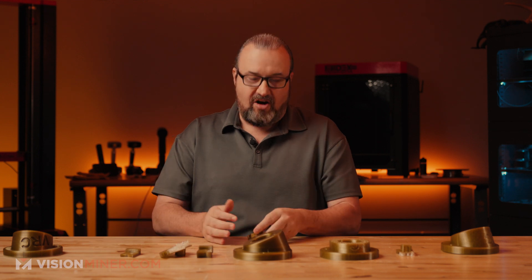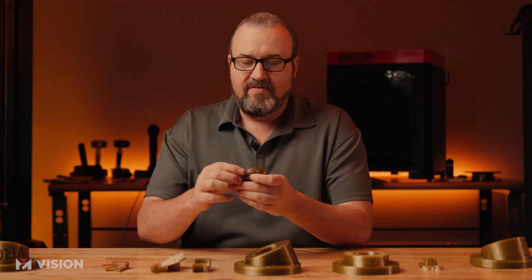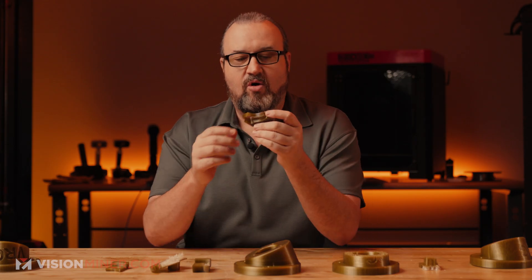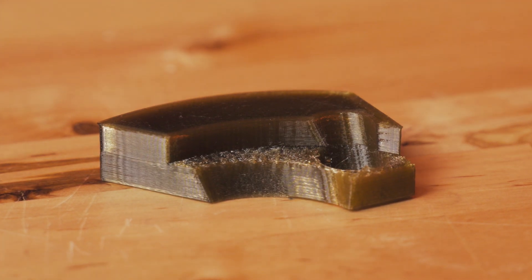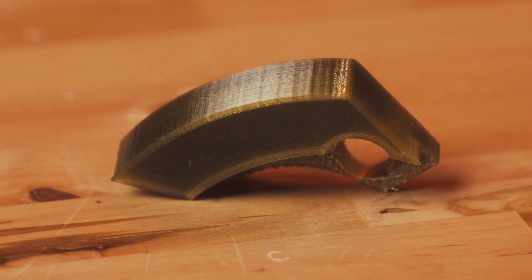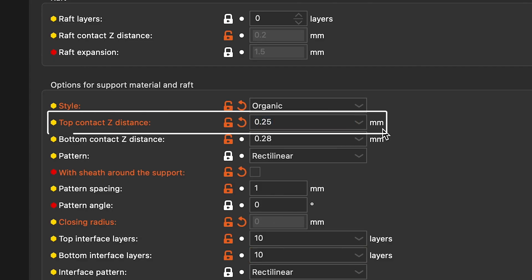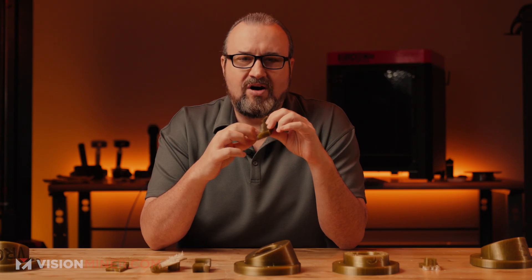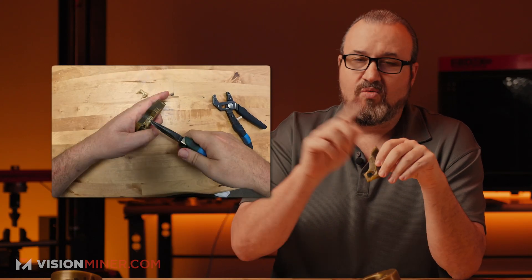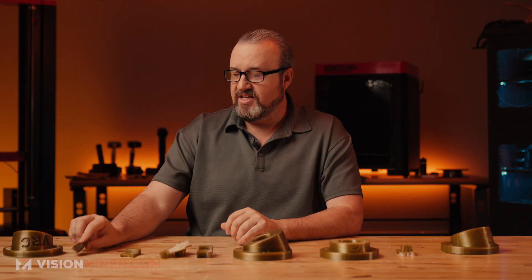I went back to what I should have done in the first place — cut off a section of the part, focus on the overhangs where I need support, and get up into that hole. I was able to get the support off by using about a 0.225 millimeter z-gap offset, but I just didn't like how rough it was. It wasn't going to work for the entire print, so I said this is a good opportunity to switch and go to dual nozzles.